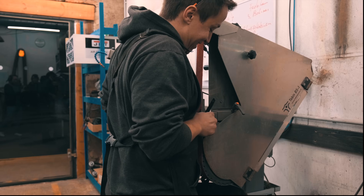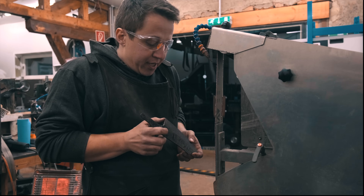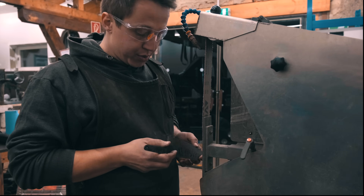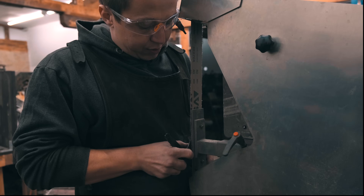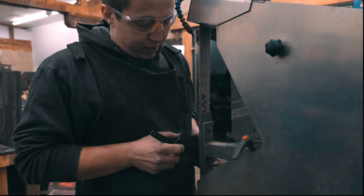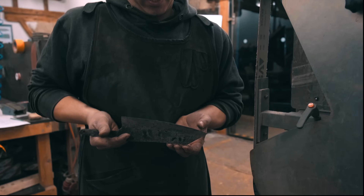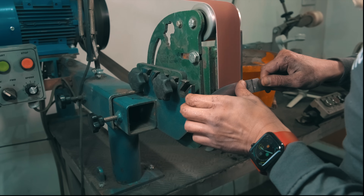Because I will be standing like this. When you're freehand grinding, it's very important that you eliminate as much vibration and wiggle room as possible and get as sturdy a grip as you can. So you will want to have your elbows and your hands as close to your body as you can, and you will work very close to the grinder. That means I have a very unnatural position — I basically have to crunch my neck all the way down so I can see what I'm doing and guide the knife. Also, I have to support the knife against the moving belt. The belt is moving downwards and I constantly have to keep it up.